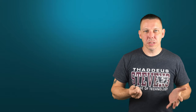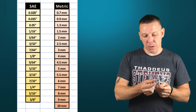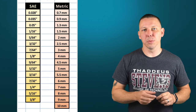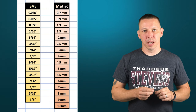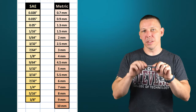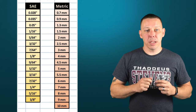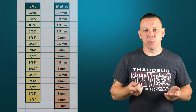The sizes are SAE and metric, just like wrenches, except they're usually smaller. Seven sixteenths and nine sixteenths are really common combination wrench sizes, but Allen's in those sizes aren't that common — usually they're smaller because they go on the inside of the head of the fastener. Like with wrenches, if you don't have good engagement and it's not fitting right, it's probably the other measurement system. If you're using a standard sized Allen key and it's a little bit sloppy, it's probably a metric.